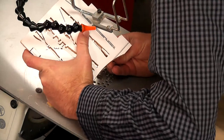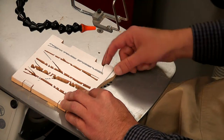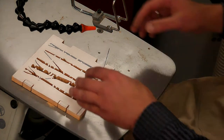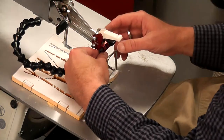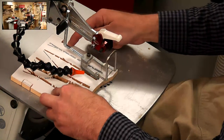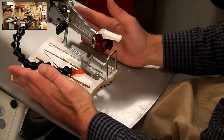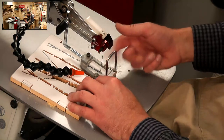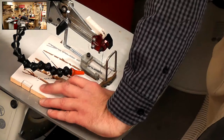So like I say, about 10 mil thick, this one. And that's something I've considered when we've taken out these little notches. They're about 10 mil in. That's going to vary on whichever thickness you're working on. And you'll see the way they interlock with the other panels in a minute. But keeping this little notch the same depth as the thickness of the wood means when we put the other sides on, they're going to sit up nice and flush to our other pieces.